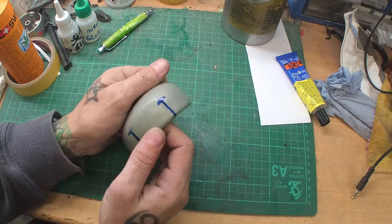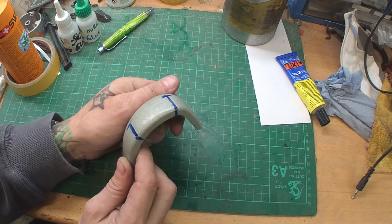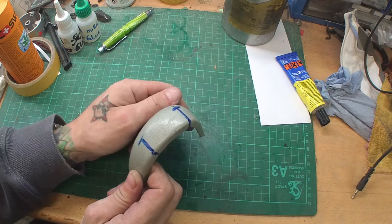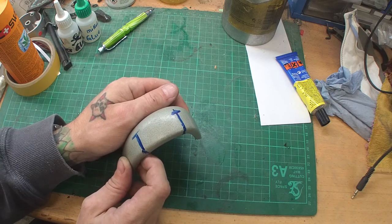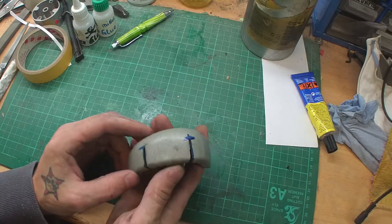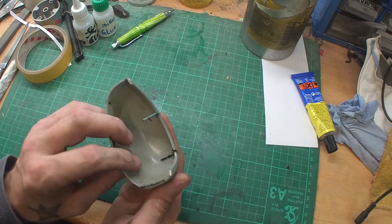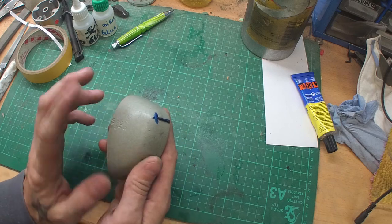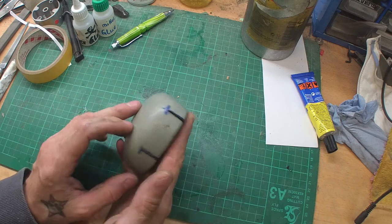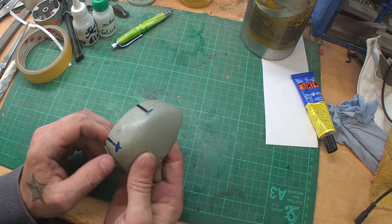Okay, now first of all I'm gonna cut these pieces open with an angle grinder, with a cutting disc. You can also use a hacksaw. I think you need a little bit longer, but it's not a problem at all. Well, now I just cut these two slots in here, as you see, with a cutting disc on the angle grinder, no problem at all. And what we're gonna do is heat up the whole piece to a pretty nice orange glow, so we can flatten it out.